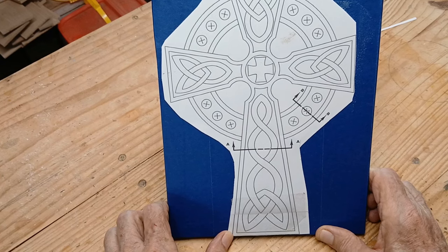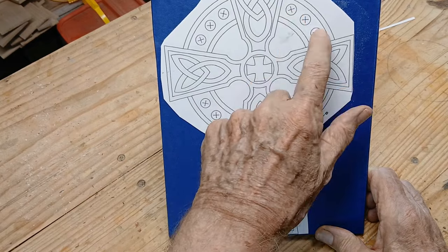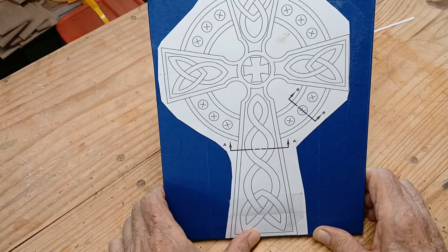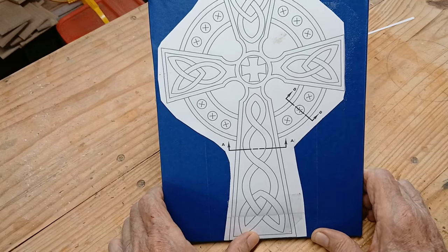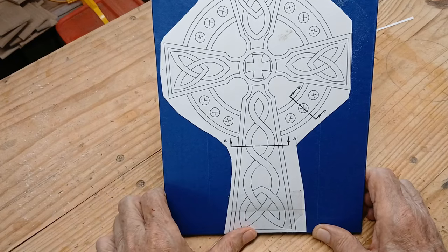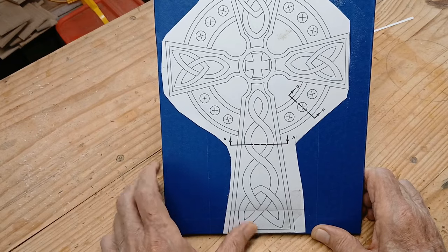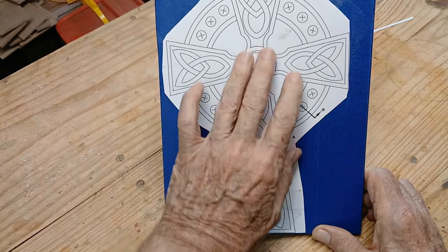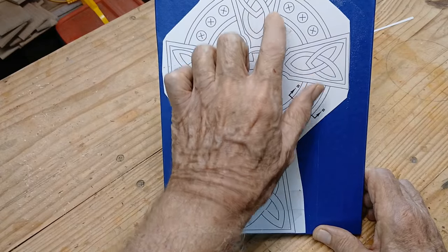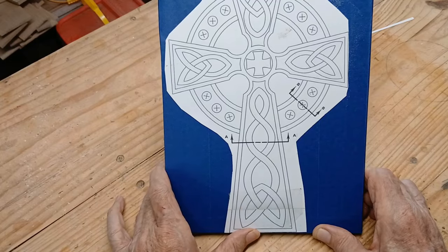I'll put the title of that down in the description. But these are to be drilled out, a 3/8 inch hole. And then you take some hole plugs, some button plugs, and glue in those. I've got some 3/8 inch ones coming. They'll be here tomorrow. But you glue those in there, and then if you separate the patterns, you cut these sections out of the top layer, which is 1/8 inch, and then glue it all back together.